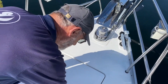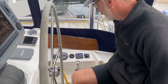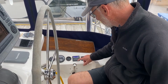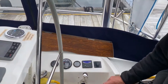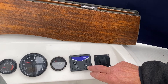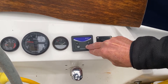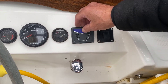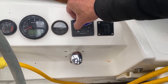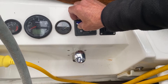The other fill points are clearly marked and found on deck. The engine will idle at just below 1000 rpm. To stop the engine, hit the stop button and hold it down until it stops. Don't switch the power off first — if you switch power off first, the solenoid won't work. So first hit stop and hold down until it stops, then press the power button off and hold that for a few seconds until the gauge stops working.